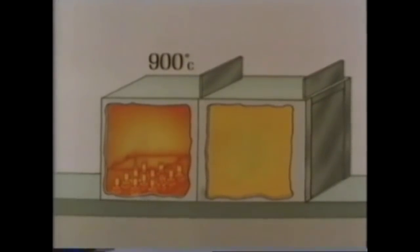The carburizing gas here is a mixture of cracked methane and air. The gas is passed over the components, completely covering them for 10 hours. The case is then carburized to a depth of 1 millimeter, and the surface now contains 0.8% carbon. The original material contained 0.1% carbon throughout. An X-ray photograph indicates the type of effect achieved. The carbon case shows up as white.